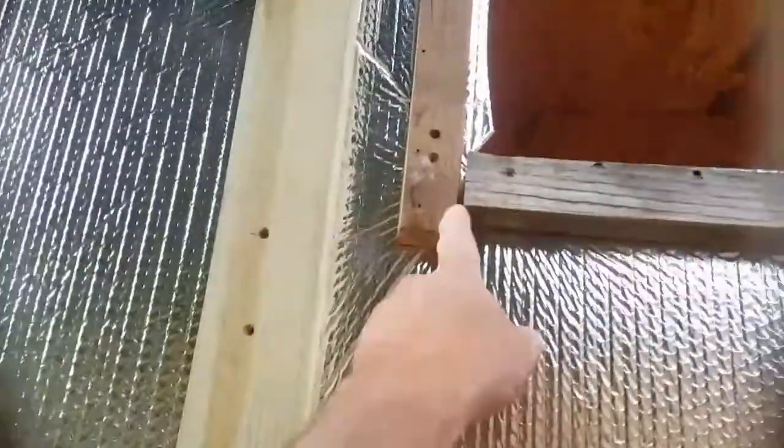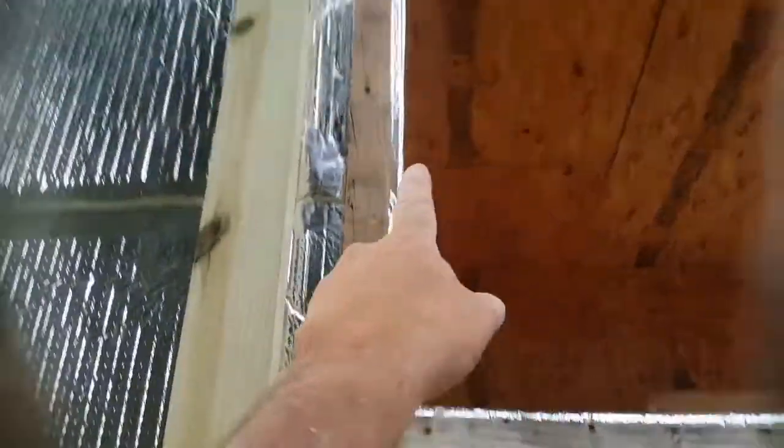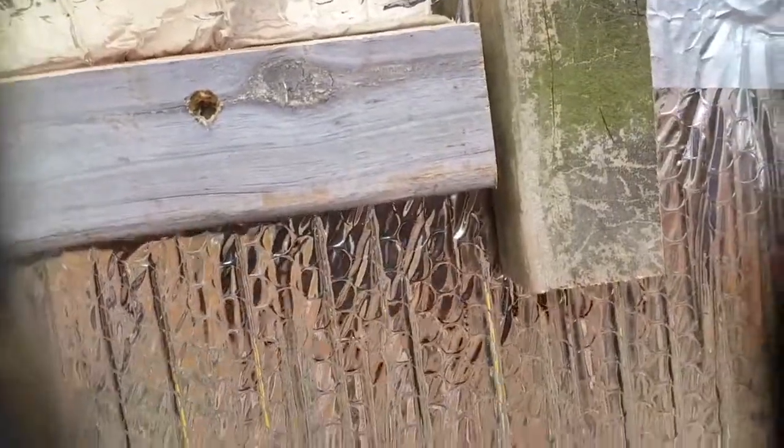And then Tim got all of the strapping on the walls, which will be our spacers under our rain screen. You can see the spacing of at least 1/4 inch up to 1/2 inch around the windows, and how the top strapping runs past the side straps, which run past the underside strapping. That way everything waterfalls and works its way down. Spacing everywhere is important so that all the wood can breathe and dry out.